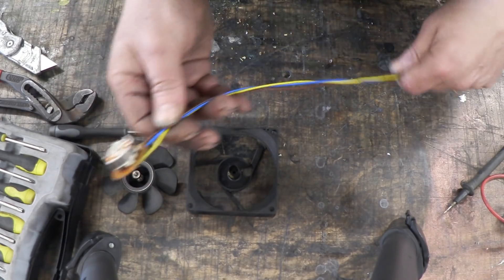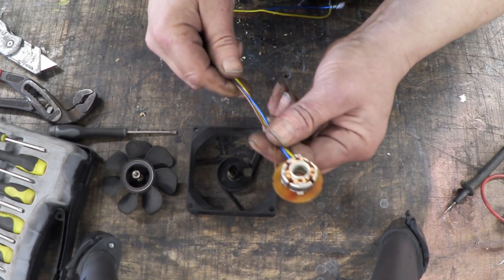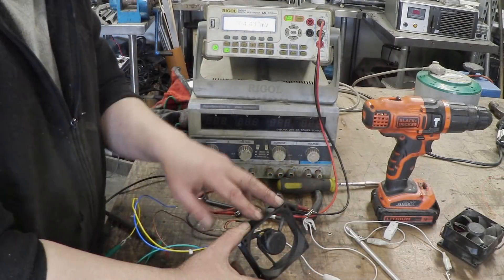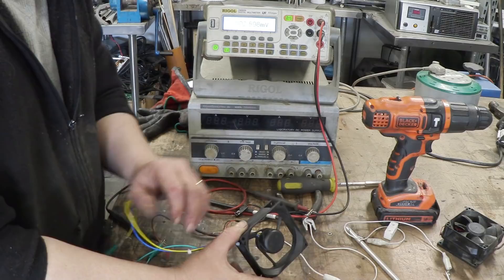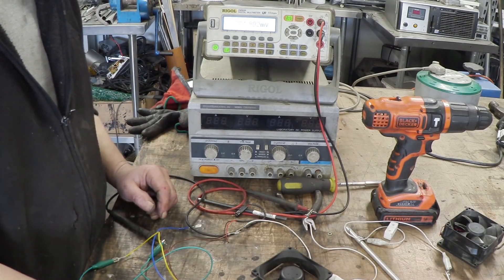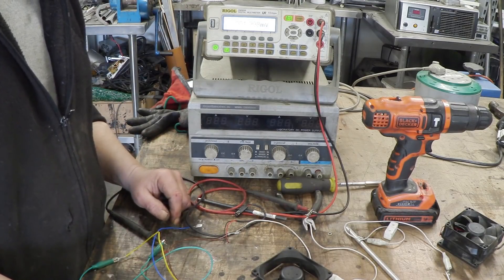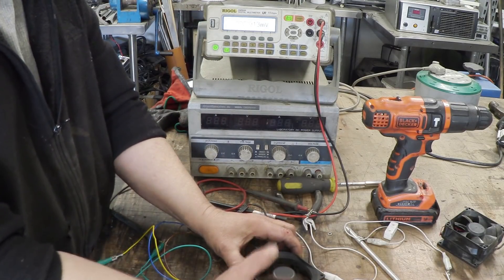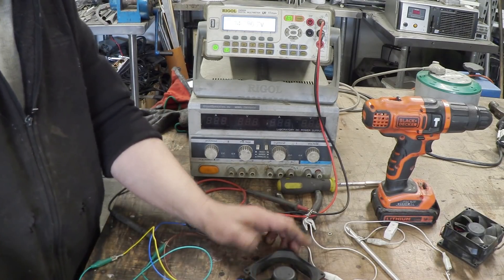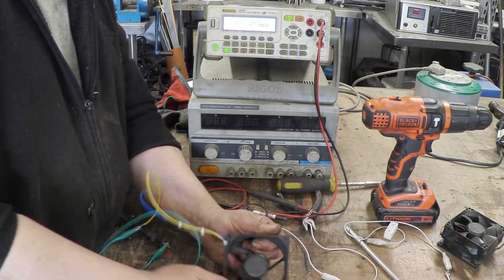This is a three-wire version — you can get four-wire versions. If you have a quick look on the net, it'll tell you about soldering up the four-wire, but it's no more difficult than that. There it is all put back together with the fan blades broken off, and that is a three-phase generator. I've hooked it up to the meter across two phases, and if I spin it by hand — look at that — it's four volts out of it immediately. That's just crazy.